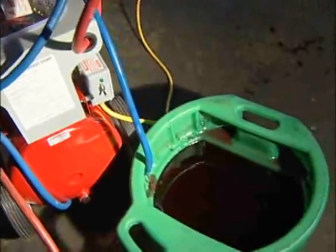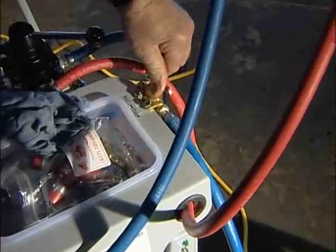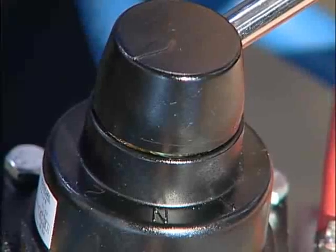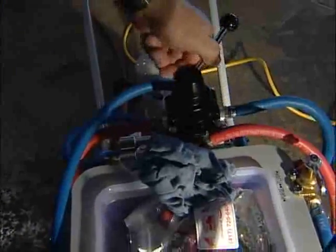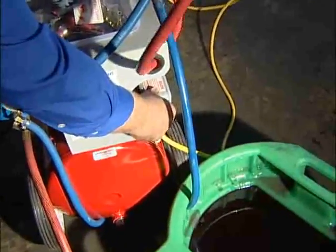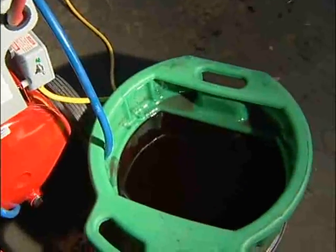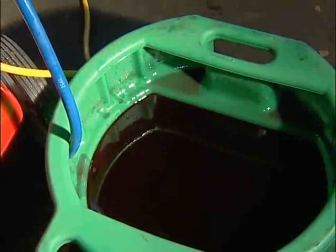After the pre-purge, we're going to turn this back to flush and we're ready to go. Make sure that your needle is in the number two position, pointing toward the blue hose. Turn the unit on and check your flow meter — we're pulsating 1,750 times per minute. We will let this flush for a full 15 minutes. At this time we're also going to turn on the air.